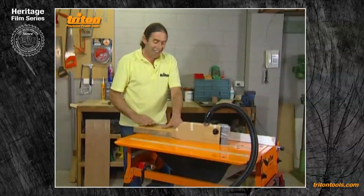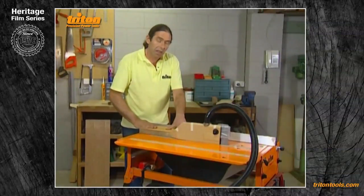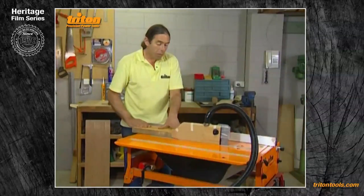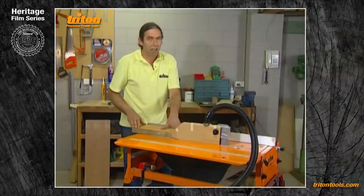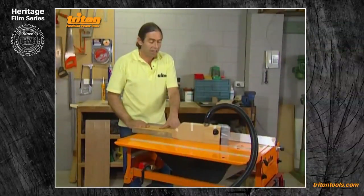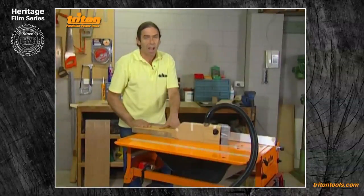Don't take me seriously on that! But really all you're doing is pushing this piece between the blade and the fence. There's no off-cut to worry about. Every piece you push through this gap will come out exactly the same size no matter what size it was when it went in, so there's probably no need to do anything more elaborate than stick a bit of cardboard on.